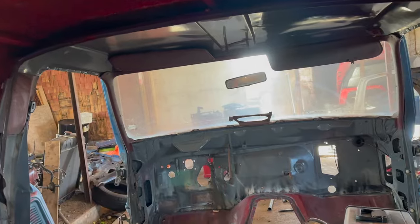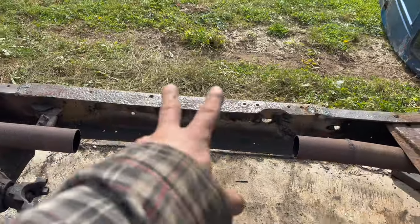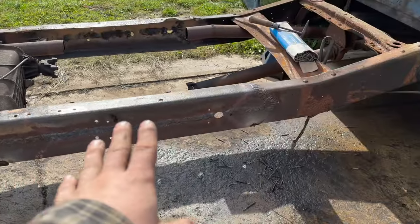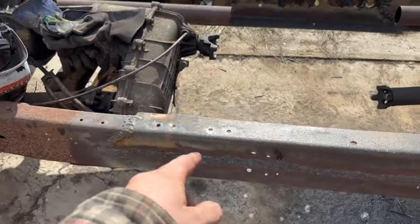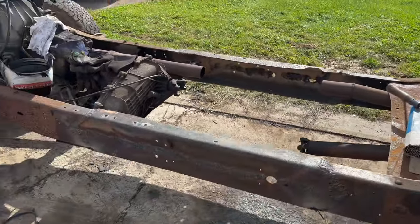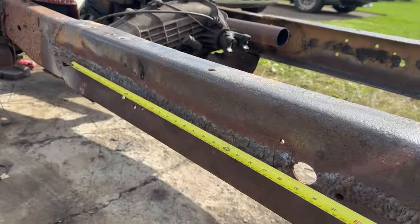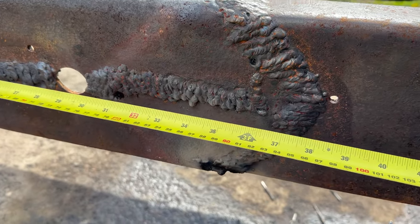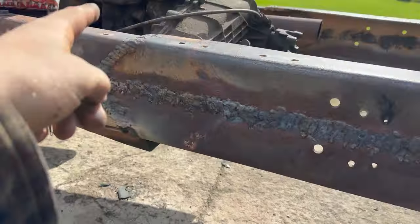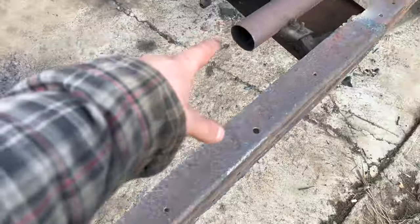I'm gonna let that dry but keep working on the frame in the meantime. Got the lengthening on — still got to wire wheel the whole thing. There's still a lot of boogers, slag, and drips — just chop them off. I basically did a whole bunch of stitch welding and realized I'm not as great with the stick welder going up and down, so I had to do little stitches after my main pass. We did the back side and the front side — she's all set. If we go to the middle of the triangle, we're looking at about 33-34 inches, and we've got good penetration on both sides.